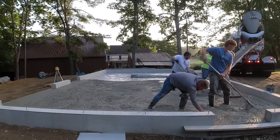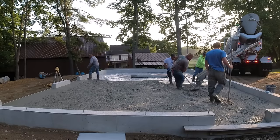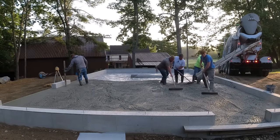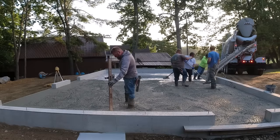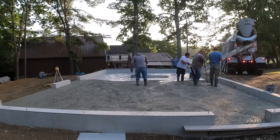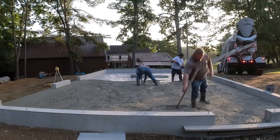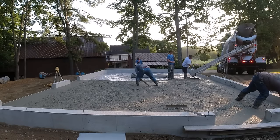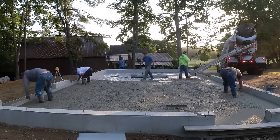A five-man crew in the summer works out great for us because we're usually doing these things with just three of us. What we like to do when there's two trucks is completely pour out the first truck, get it poured right out, get it as close to grade as possible using the chalk lines. What Darren's doing right now is checking the laser, making sure everything's perfect. He's going to make what we call a wet pad in the middle — that wet pad will be the same grade as the outside edges because this floor is flat. That gives us something to screed off from in the middle. We're using a battery-operated power screed today, and that's what we're going to be timing.